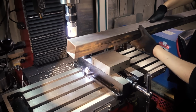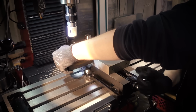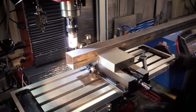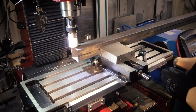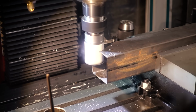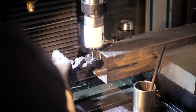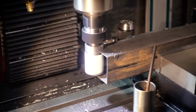And the next thing is to drill the miter for the bottom bracket. I'm using a hole saw with the bottom bracket diameter, and I'm just drilling straight down 90 degrees. So this could be done in a drill press. And on a tube this big, these hole saws tend to bottom out, so I'm cutting off a piece of it and then I'm doing the rest.